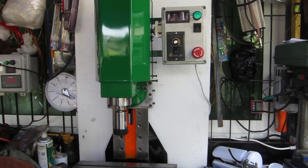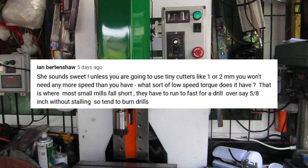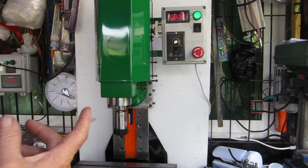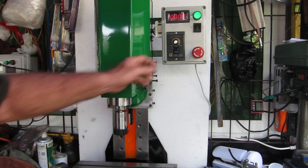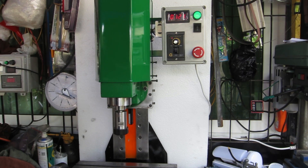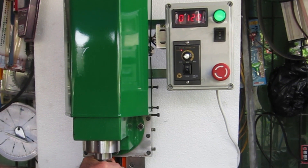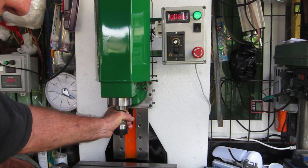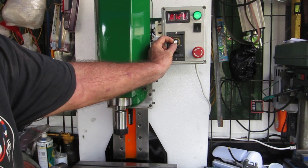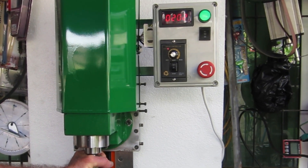If you're enjoying this video, give it a big thumbs up and consider subscribing if you haven't already. One of my subscribers asked after the last video how well this washing machine motor handles a load at low speed. Let's have a look — I'll fire it up at around 120 RPM and load it with my hand. It bucked initially and then the tachometer built into the motor kicked in and started to compensate. At really low speed it doesn't fully compensate — you get about half — but it doesn't stall completely. Going a little higher it does a better job.